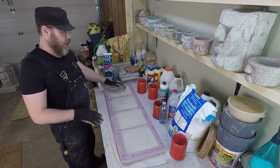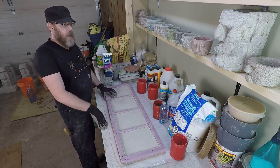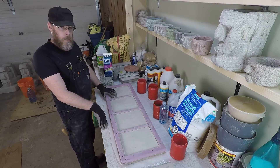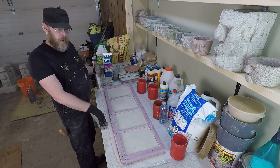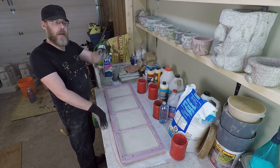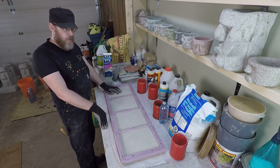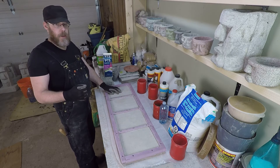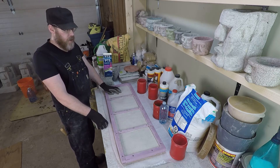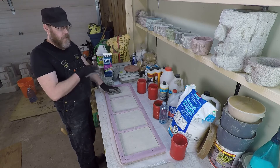The biggest tool in your arsenal would be varsol. I would soak the floor with varsol in order to penetrate into the concrete and break up the oil that's in there. Hopefully that will be enough such that you can put something like sawdust on there afterwards to soak up all the varsol, and then at that point I would rinse very thoroughly.